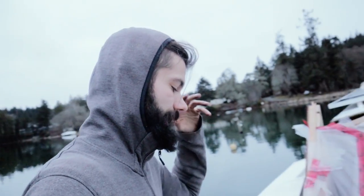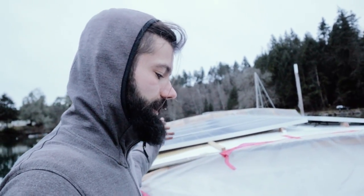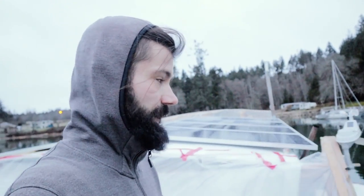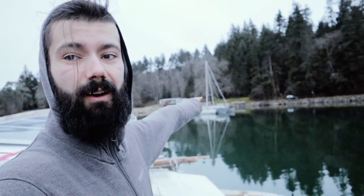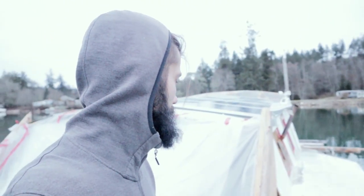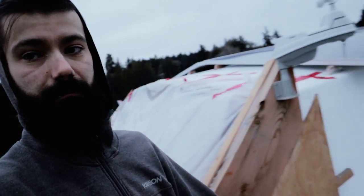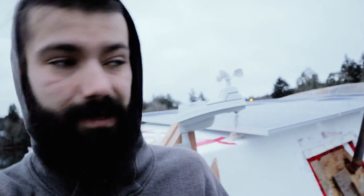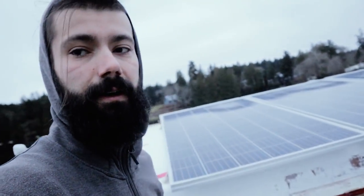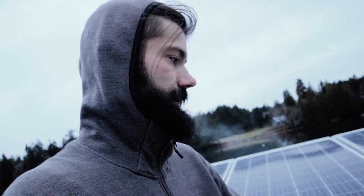It arrived yesterday. I routed it, sanded it, stained it, and spar varnished it. But I didn't get any of that on camera. And it's sitting right over there by my truck. So we'll have to get that out soon and put it in the right spot so that I can take this beam out, as this one's driving me nuts. Cut it out, fix all the rot underneath it, and get this beam that I bought earlier into that beam's place. And then we'll have an extra one, and I think I'm going to replace that stern beam at the back with that little spare beam.